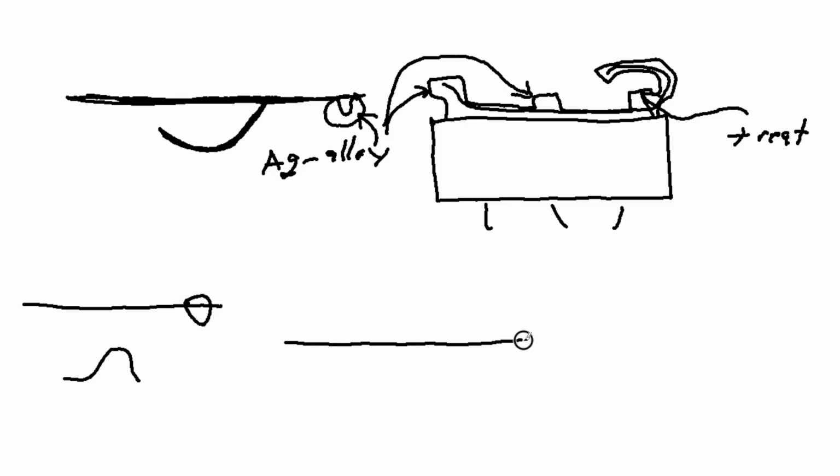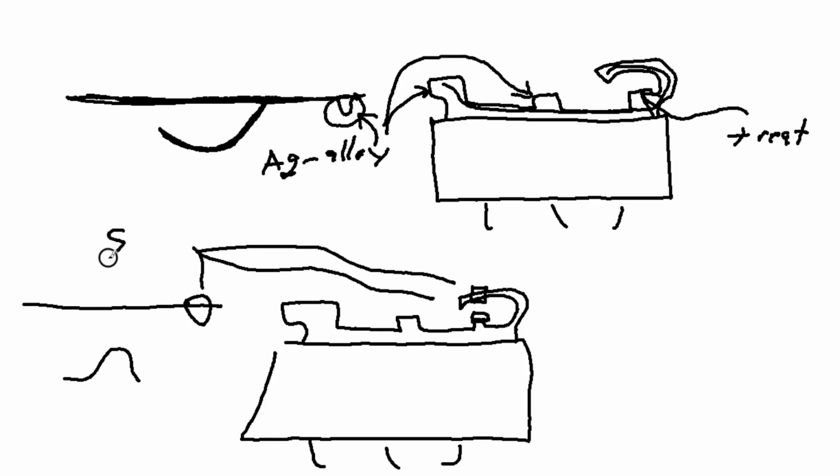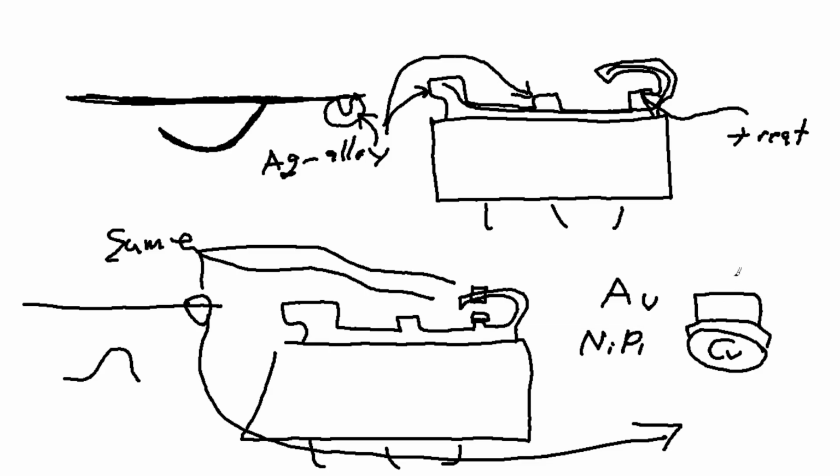Then you have your rivet that you can optimize for electrical conductivity, as well as your base plate that's electroplated with a noble metal for higher life, lower corrosion, and better conduction. And then you have your rivets on the on and the off positions here that are made of a separate material that's stamped into the base plate, and that's the same material with the same hardness as your rivet on your click plate on the top, and that's going to be made out of materials that are specifically built to switch the loads that we're talking about.